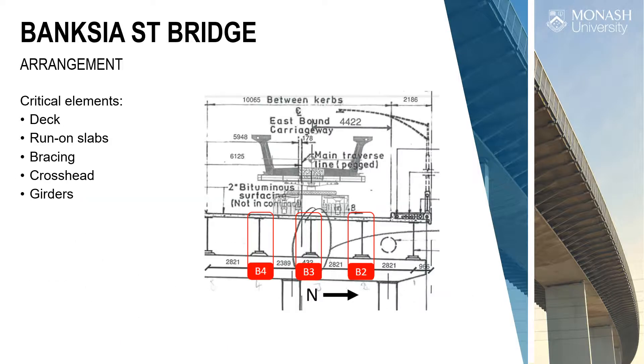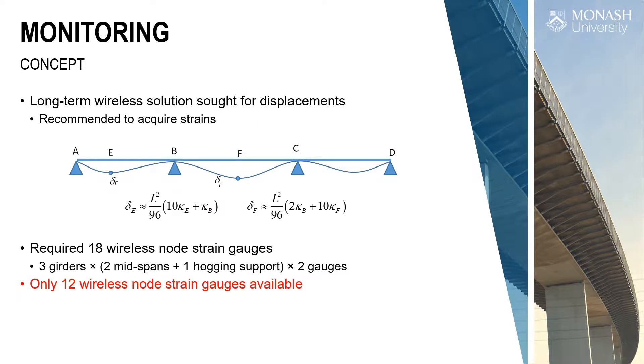The load ran along the centre of the three beams — the bridge was widened but we stayed on one side, with the load position marked with yellow paint. Because it's a continuous beam, the relationship between strain, curvature, and deflection changes slightly. Going back to basic structural mechanics and virtual work, we can come up with approximate equations, presuming the load is uniformly distributed — which is reasonable given a 72-metre-long platform over these spans.